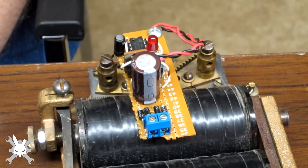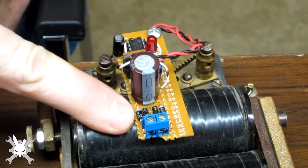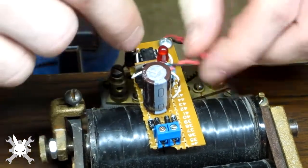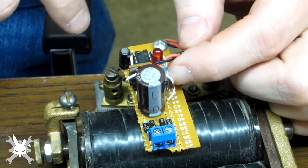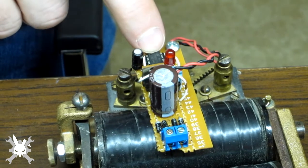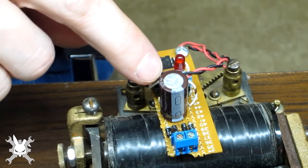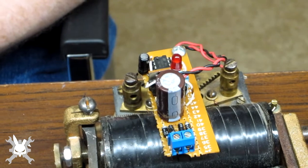Looks like you got a cap. Yep. Terminals, rectifier diodes to make DC out of AC. Main filter cap, that's 20 volts DC. LM7805 regulator. Yep. Output filter cap. 555 circuit, about 1.5 hertz, 50% duty cycle. Level shift transistor, and then an NFET. So the NFET's running at 20 volts DC.